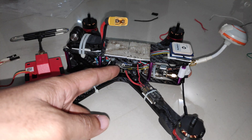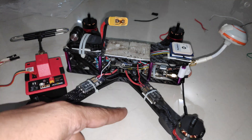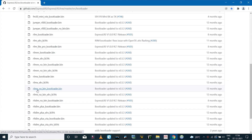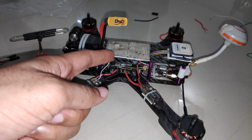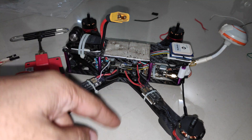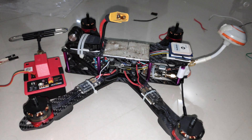The first thing we have to make sure is that we are using the correct bootloader file from the ExpressLRS website. For every R9 receiver, whether it's the R9 MX or R9 MM, we have two bootloader files — one with the button bootloader and one without, which is labeled as the no-button bootloader. As I showed in my previous video on flashing ExpressLRS on the R9 MX, I used the no-button bootloader file, and that's very important so we don't get other errors while making changes in the future.